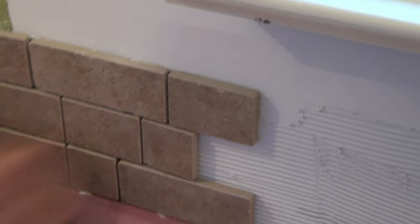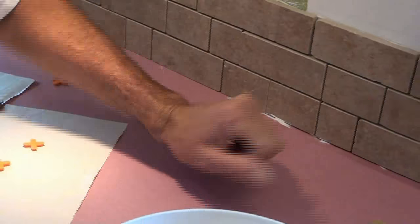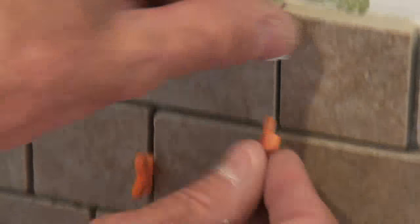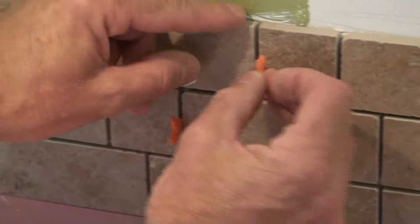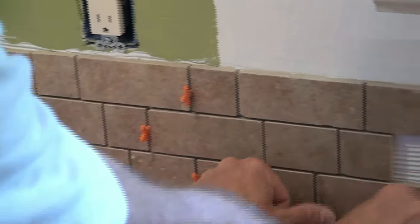Flop them in, let them sit right down on the counter, bump them in with the palm of your hand, then get a spacer in between each tile. Right where I joined them together my spaces were tight, so I slid them over a bit. Keep an eye on everything — put a spacer wherever you need it. If you get too much mastic, it can push tiles high or low. The mastic sets up fairly quick, so I can come back and pull spacers out as needed.